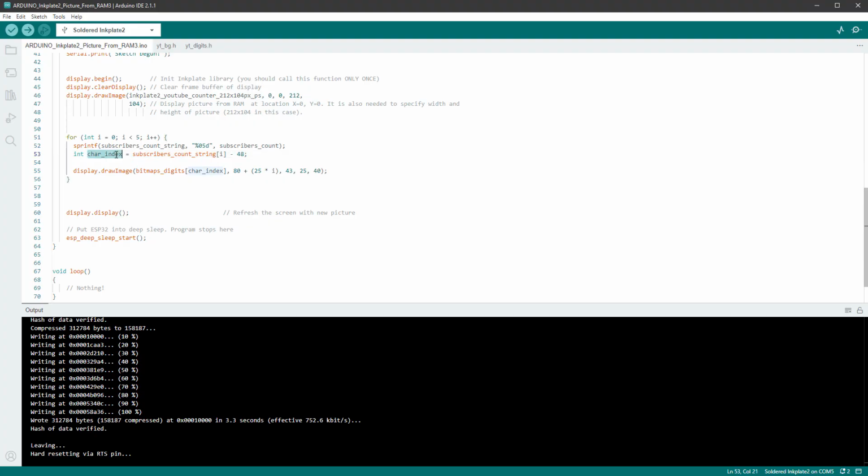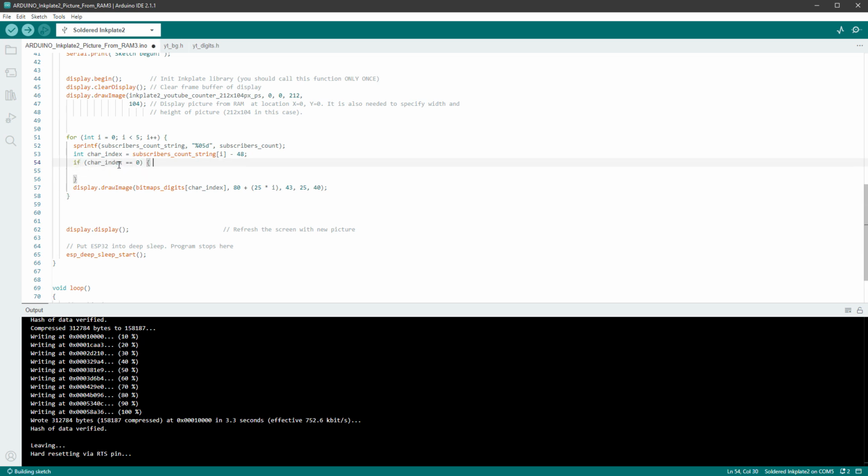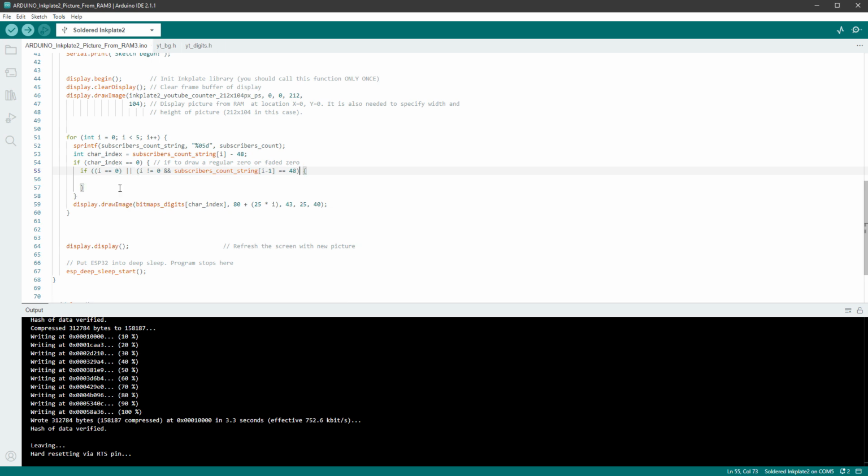Before drawing the digit, we want to see if the character index is 0. So if the character index equals 0, we need to find out if to draw a regular 0 or faded 0. And we will draw the faded 0 in 2 different cases. The first will be if the I equals 0, so it's the very first digit. Or the second possibility is if the I does not equal 0, so it's not the first digit, but at the same time the previous digit was 0. So if the subscribers count string of index I minus 1 equals 48. So in both of those cases, and let me add a few more parentheses, we want to draw the faded 0, which means that the character index should be set to 10.